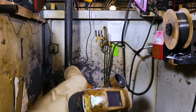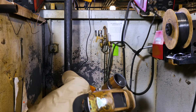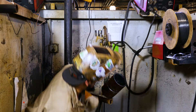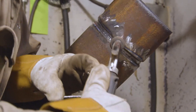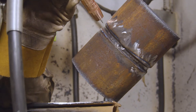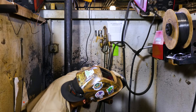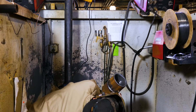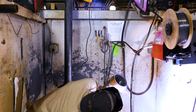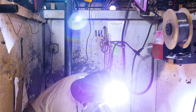The important thing to remember is with the 6G, you kind of want to size it up — it's a monster. You don't want to just step into the ring without knowing what you're getting yourself into. So usually what I do is called a dry run: I make sure I'm comfortable all the way through to the top. I feel pretty good about that, so I'm going to drop the hood and get to burning. I'm keeping that puddle away from the beveled edge so that we have our guideline.